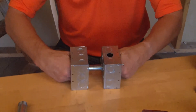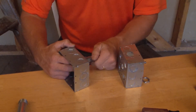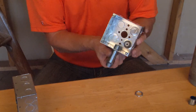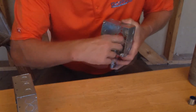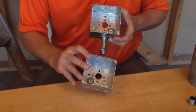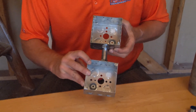Another popular installation of this product is coming off of a box. Sometimes with an electrical panel or a box, you need to put in some type of sub-box below it. It's very quick and easy to simply mount this with the lock nut, attach it to the bottom of the box like so, spinning on the lock nut. You can then remove the top knockout and put another box directly below it, anytime you need to put in switches for motors or a variety of other applications when you need a chase connecting the wiring between two positions.